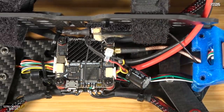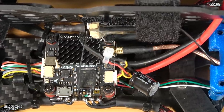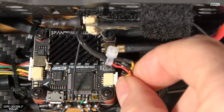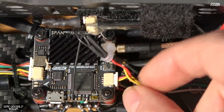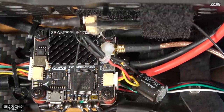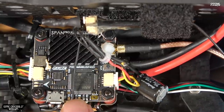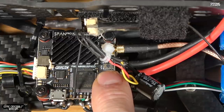We have a setup for Crossfire, and this is the way Crossfire looks when you have it plugged into the SPAN. Traditionally we have our SBUS connector here. I have my 5-volt ground and signal wire there going in just like I would with SBUS. Then we're going to take and solder the next wire to T3 — that's how you're going to hook up Crossfire on the SPAN. That fourth wire over on channel 4 on your Crossfire Micro is going to go to T3. Inside Betaflight I'm going to show you that coming up as well.